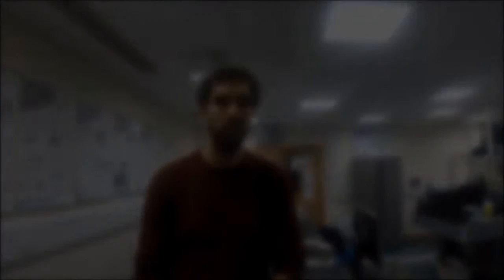A quick demonstration will show how LPGs operate. This is a transmission spectrum of an LPG using a broadband light source and a spectrometer. Fabricating LPGs produces attenuation bands at certain wavelengths. These bands appear at wavelengths which satisfy the phase matching equation.